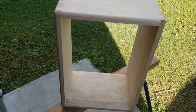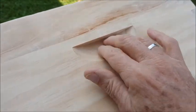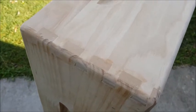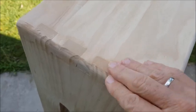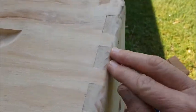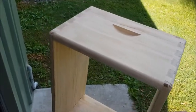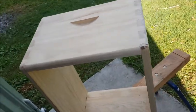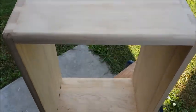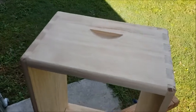One of these will take a 12-inch speaker. Downsides are you have these handle cutouts — I think I can live with that. Also they can be a little bit rough when you put them together and require a little bit of filling and sanding. I've gone all the way around this with a router to smooth off the edges, so a little bit of extra work is required to get it looking nice, and the quality does vary from different suppliers. This one is made of very nice straight pine. I'll have another one which I'll show you in a moment which is not as good quality but still quite usable.